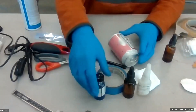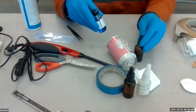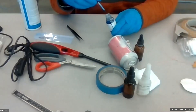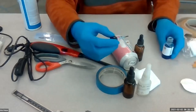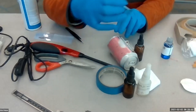So now I have to use my catalyst. I'm going to do 10 wipes on the side of the bottle: one, two, three, four, five, six, seven, eight, nine, ten. And then one stroke across the backside of the gauge. Okay, just like that.